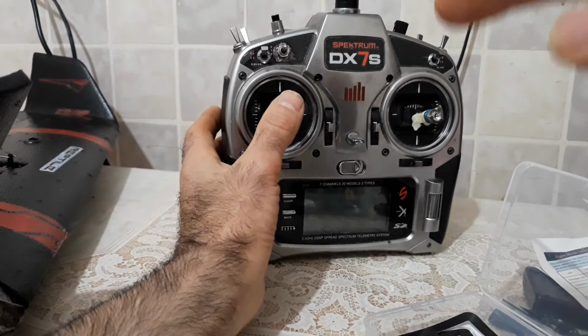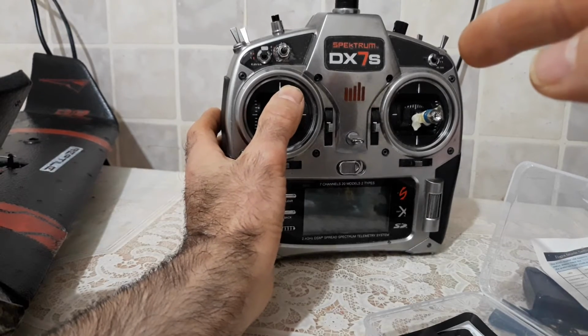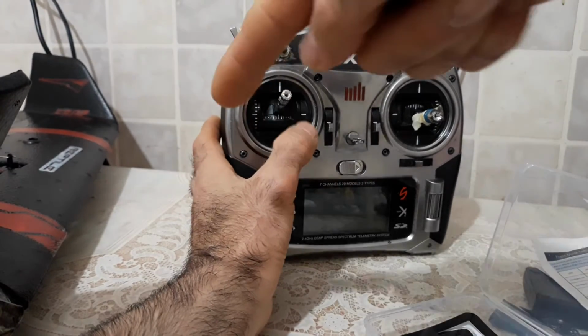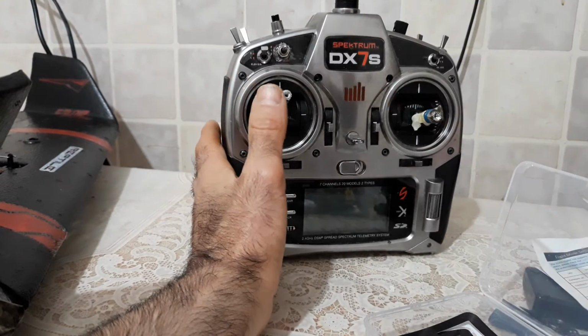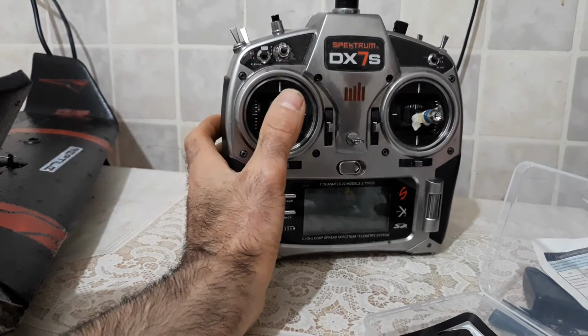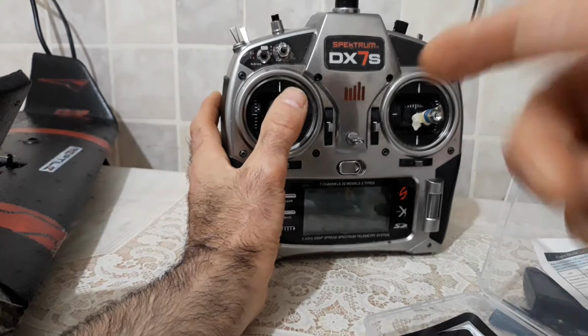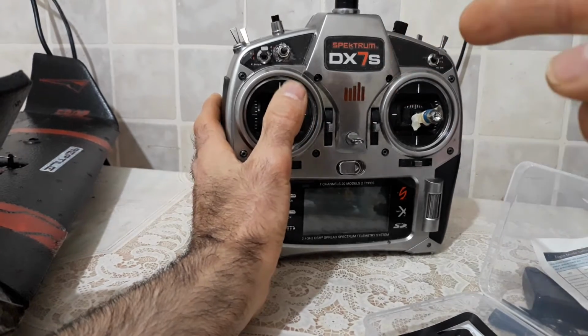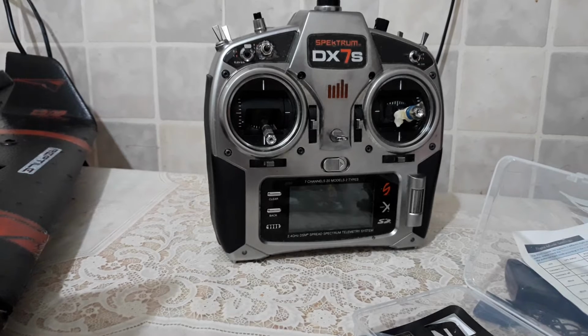Make sure, because when you do loiter, sometimes in the turn, it slows down a bit. Make sure when you do RTH, failsafe, you have enough speed. When it does loiter, in the turn it slows down a little bit, because it gives quite a bit of angle to turn the plane. Sometimes it seems a bit too sharp. So some speed is suggested. Make sure you have enough speed, and I put 65% which is enough for me. This is my big advice.